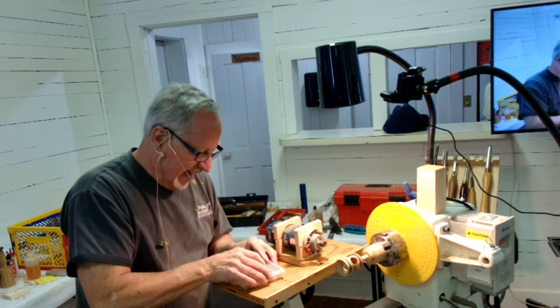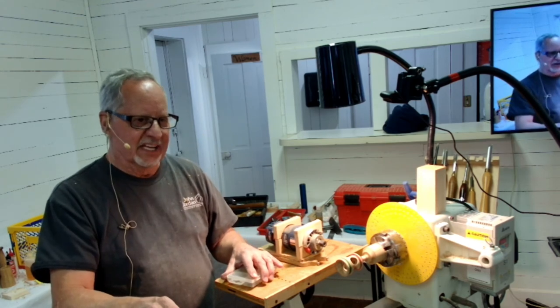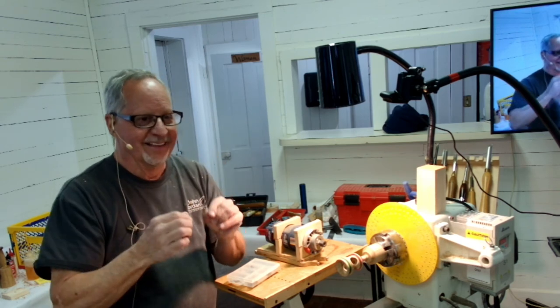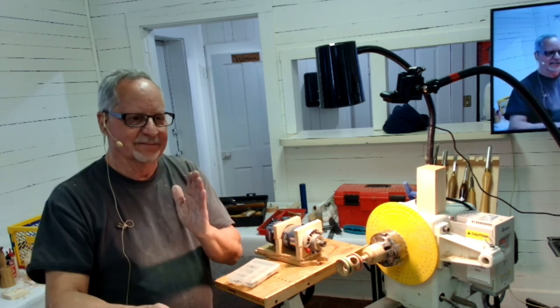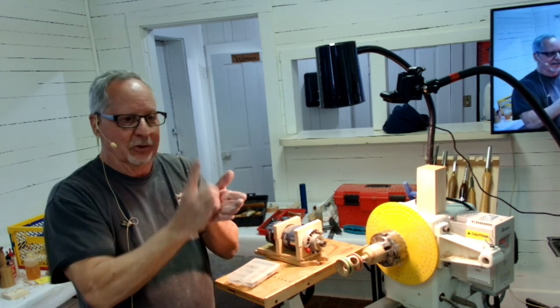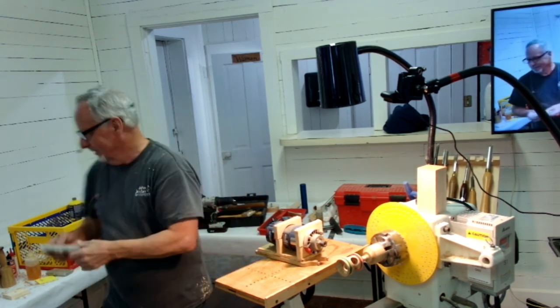The hard part about that is when you have a square dowel, it's really hard to see that this side is 93 and that side's 87. So what I do is when I cut them, I know the tilt of the blade. When I cut them, I take a magic marker and mark the bad side. And now when I try to glue that square block into that V cut, I know the magic mark always goes up and I don't screw up gluing them in.